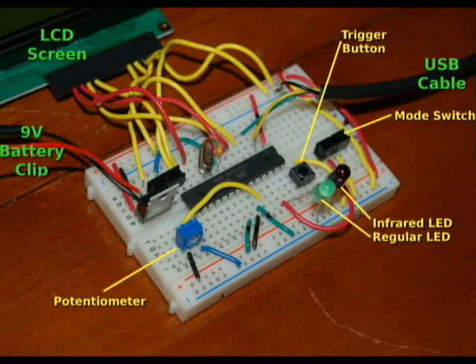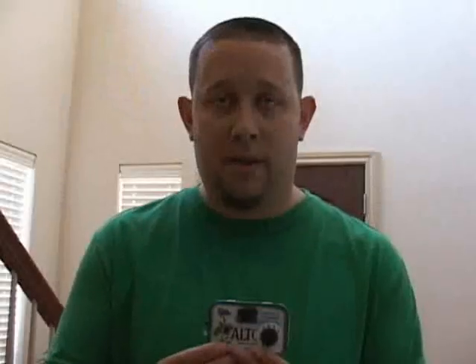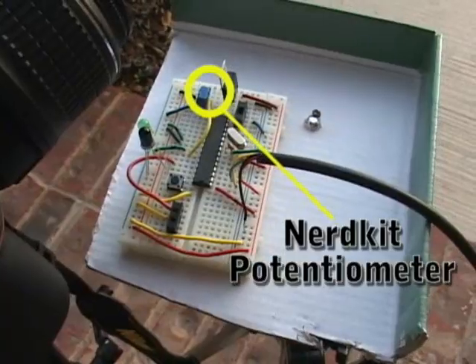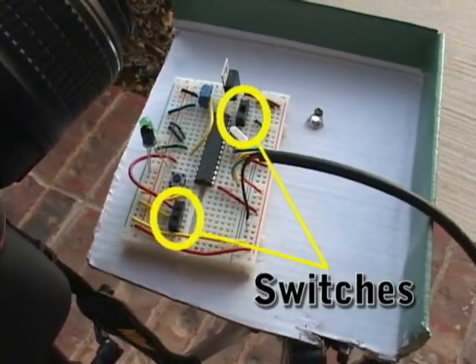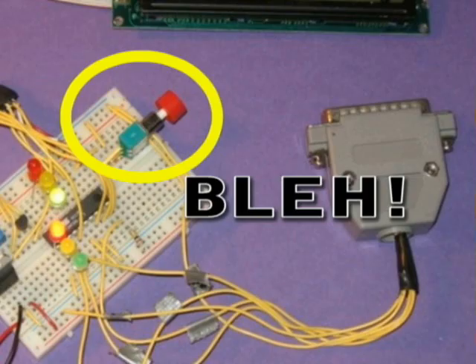The build isn't quite finished yet, but you can see how it works by looking at the breadboard. You can make your own with a breadboard, or get your own Altoids tin and put it all together. My intervalometer includes a NerdKit, an infrared LED, and a potentiometer that came out of a set of headphones. The one that comes with the NerdKit will work, but it has to be adjusted with a screwdriver, which is inconvenient. The two switches also came out of old headphones — your NerdKit has switches that work just like these. For the trigger button, I used a small one from Digi-Key for about 59 cents because the NerdKit's button is big, bulky, and red.